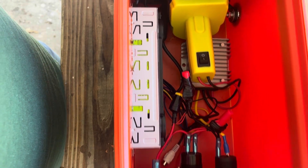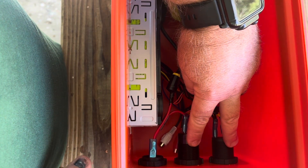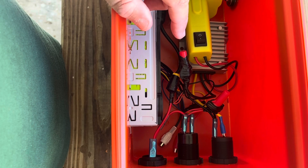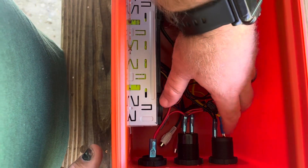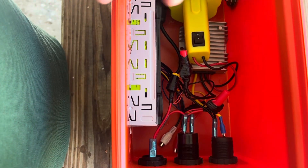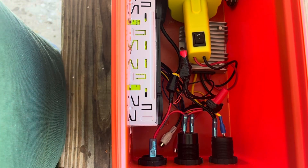I had to figure out exactly how I wanted my power to run. When it comes in from the battery, I wanted my two power points in the front of the box to be hot all the time, and the rocker switch to run my lights. I wanted my radio hot all the time so I could kill everything with the main switch, but also be able to leave it on and run the power sockets and radio without the lights on. I ended up using wire nuts because all the wires for the radio, power source, and power sockets were differing sizes — so I twisted them, locked them down, and put a little tape on them to hold them in place.